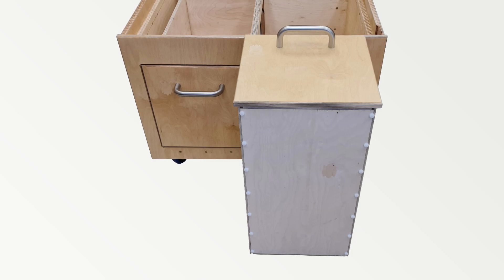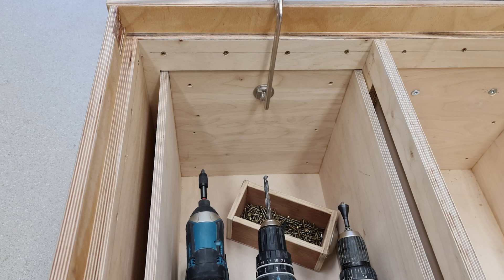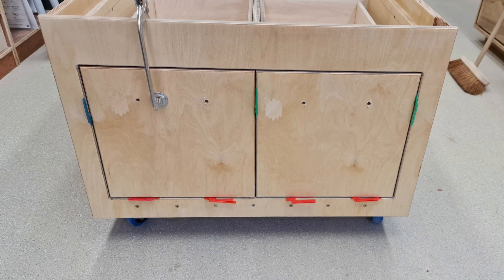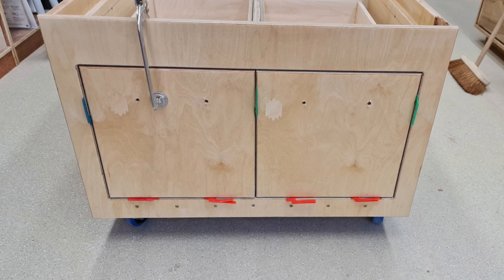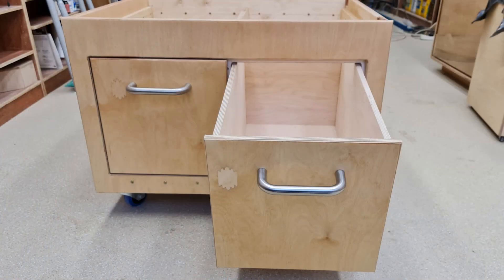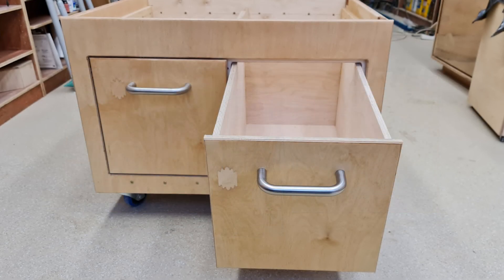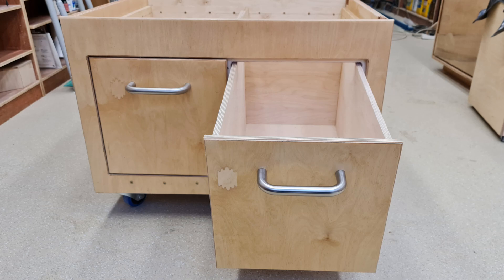Normally when using runners I make the drawer bottom slightly recessed so it is never seen from the side. The drawer box fronts were drilled for four millimetre screws and the 18 millimetre drawer front pre-drilled for the pull handle. I used a crate clamp to clamp the spare drawer fronts to the drawer boxes, drove the four millimetre screws, and drilled through and fixed the handles. Finally I applied a coat of Zinsser shellac sealer — two-thirds Zinsser shellac and one-third industrial methylated spirits — and found this to be very satisfactory.